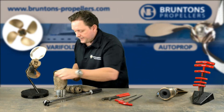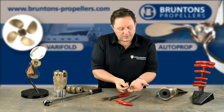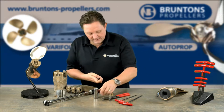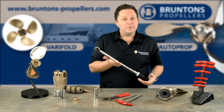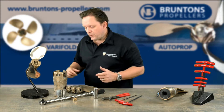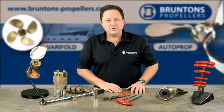And then inside the propeller here when you open it up, the factory will have the nut for it. It's got a hole at the top with an M8 bolt that's going to go inside. So this is 24mm — you just need a 24mm socket, either the yard can have it or it's available at Home Depot for about six bucks. The lock nut is the same as for the lock pins. And then a torque wrench — I carry my own. I carry the one for the propeller nut and a bicycle one in newton meters for all the smaller ones. So once you have all these tools, you're ready to go to the boat. Let's head over there now and do the installation.